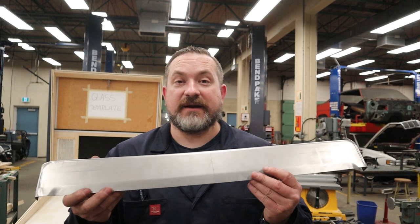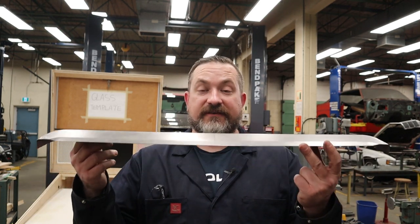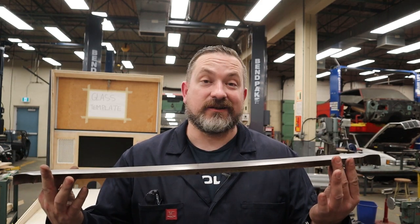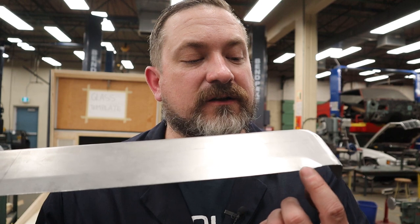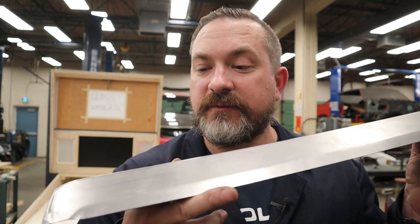All right, taking this thing out of the hammer form, I'm actually pretty impressed with how well we did here. It's very flat. It's pretty rigid considering this is 19 gauge and not 16, and it's not stainless either, so that's another thing. The detail for the front glass trim where it goes down a bit looks bang on. That looks totally authentic to me.